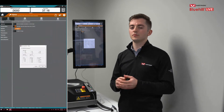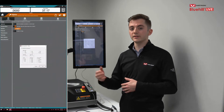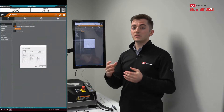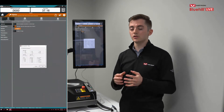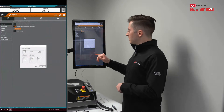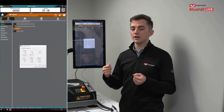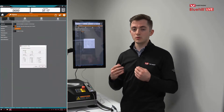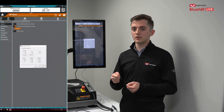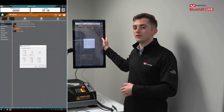The Configure window brings up all the device settings you need to make sure are correct for the frame and software to interact with the micrometer and read its outputs. All of these settings — the various baud rates, data bits, stop bits, and parity — are described in the installation drawings and manuals for the ASMD, so there's no need to memorize them. The important setting to highlight is the COM port. Any time you have a device plugged into a computer via USB, it communicates via a COM port. Make sure the COM port your USB cable is plugged into corresponds to the one selected — in this case, COM port 1.